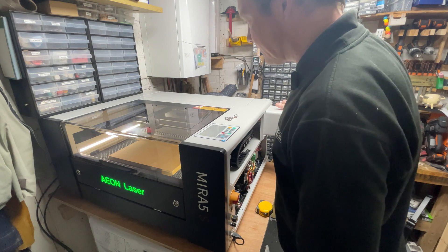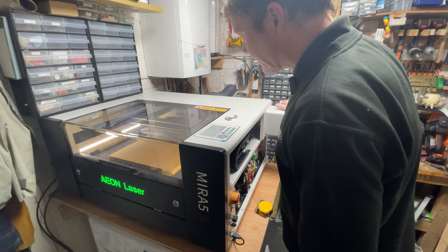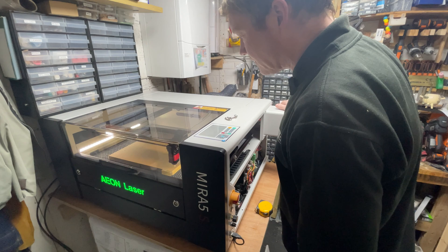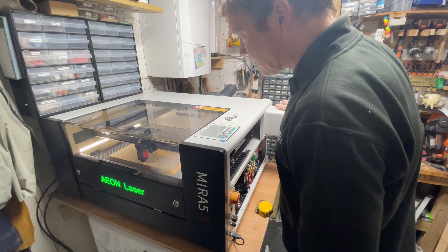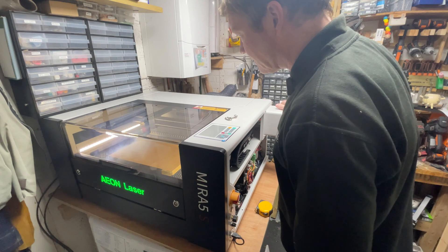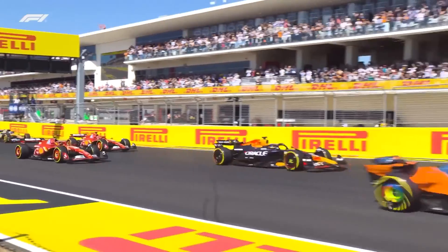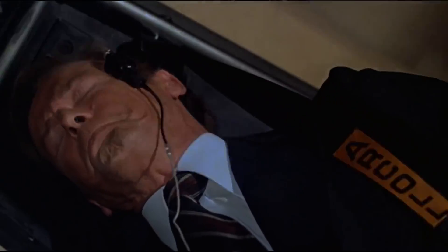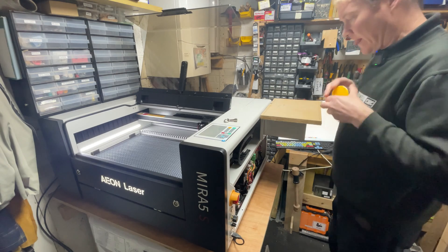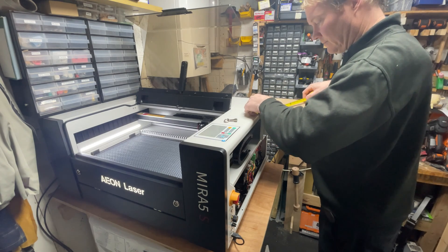While that's cutting, let me tell you about speed — we're not cutting at full speed here. This thing can go fast: 2000 millimeters per second engraving with an RF tube, or up to 1200 millimeters per second with the glass tube, and that's with 5G acceleration. To put that into perspective, that's 60 miles per hour in 0.34 seconds — enough to make a human faint. Once done, we measured the diagonal of the rectangle to ensure everything was the right size. Perfect.